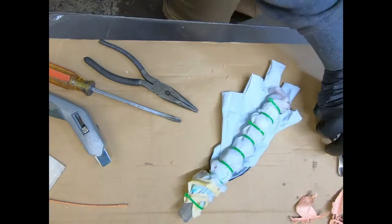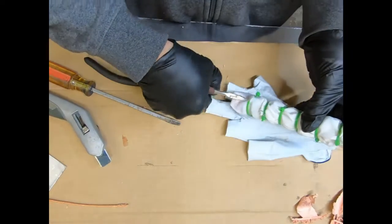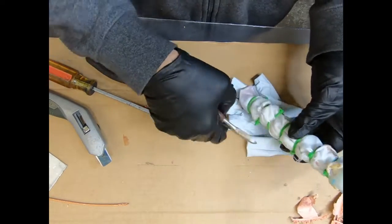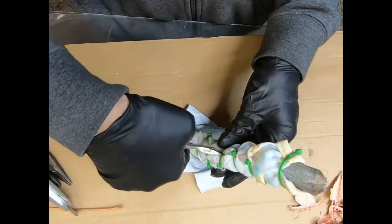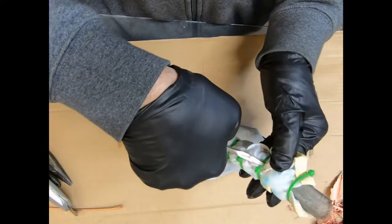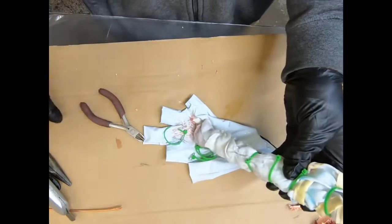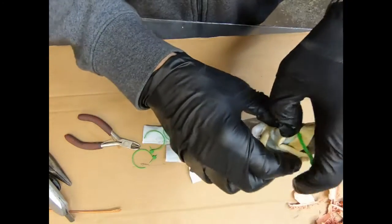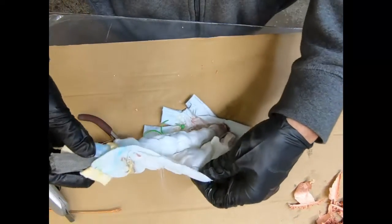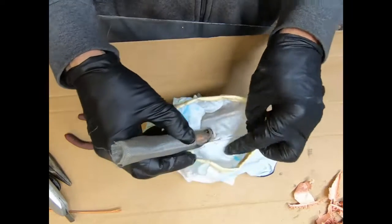Here's the anode and I notice a lot of copper powder coming out of it because this filter is just not up to par. The bottom of the jar also contained a lot of copper powder, so this filter is not a good enough mesh — that was eight bucks down the drain. You can see the copper powder coming out of it right now. We lost a significant amount; we were filled to the top with materials.